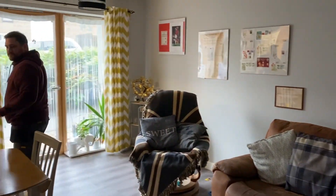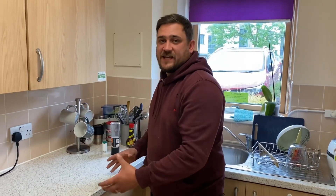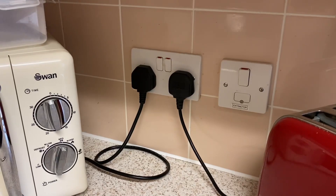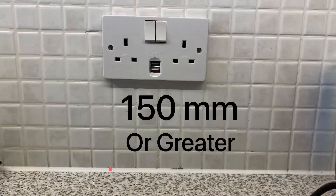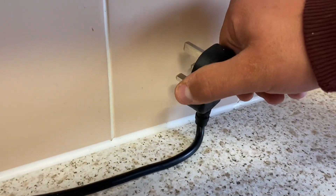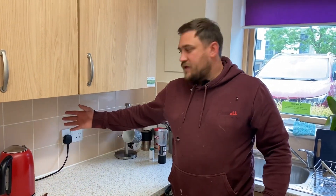I've walked through the living room, which is classed as a habitable room. The heights of the switches and sockets there are considerably higher than what we're used to seeing because it's been adapted. Now in the kitchen, it's actually the work surfaces which will dictate where we need to apply our accessories above them. This hasn't been adapted, so this is standard — it could be lower. The important thing to note with accessories above a worktop is they should be 150 millimetres above it. This is to stop flex from getting damaged; if it were too low, it would put a lot of pressure on the conductors within that flex, so this clears the worktop area and makes it easier and safer for accessories to be connected.